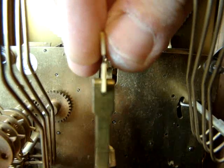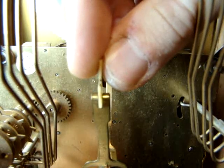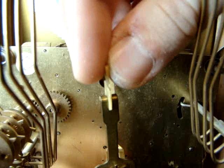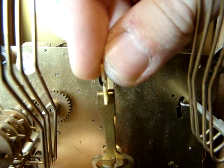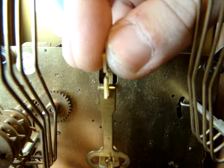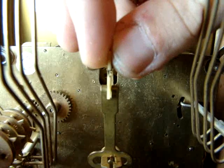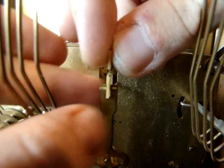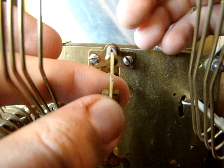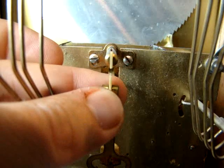While passing it to the other hand, you want to first make sure to put the leader through the crutch assembly. Hold tension on it while it's being pushed onto the crutch so that it doesn't fall off while you're inserting the suspension spring into the top of the suspension post. This is an ideal situation for the spring fitting in an unaltered suspension post. You may have more difficulty if the suspension post has been crunched down to fit an aftermarket undersized spring or if the suspension post needed tightening after fabrication. Make sure to keep all the tension on the top block and not put a lot of effort into the bottom block, as that can put stress onto the suspension spring and could potentially damage one of the leaves.